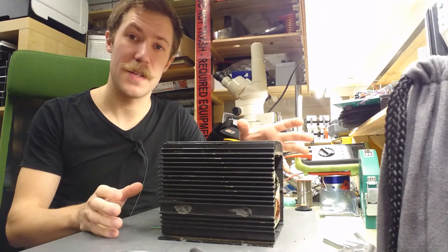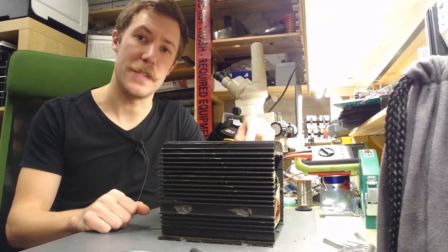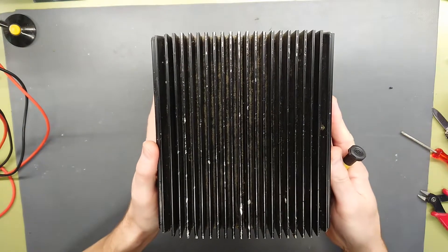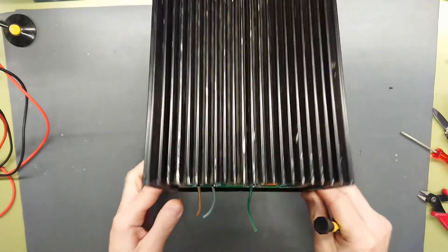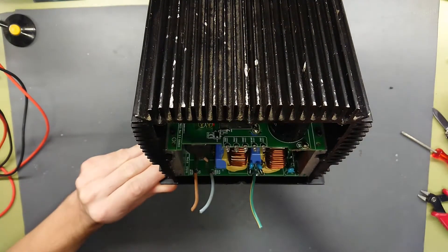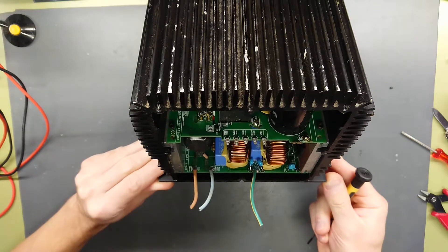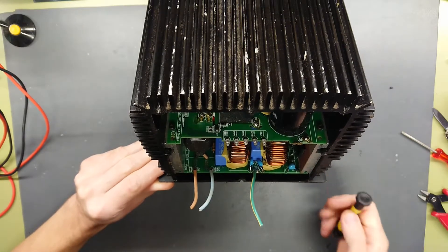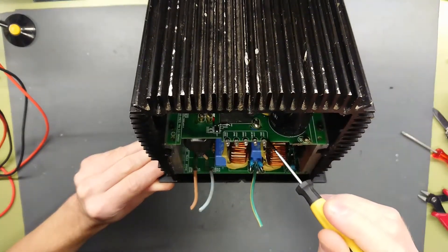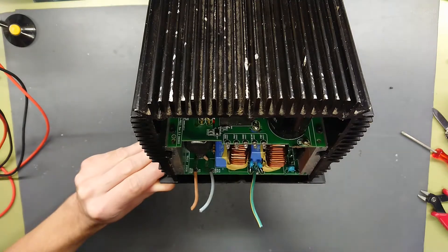It does have a few markings on the PCB that suggest this is probably a battery charger for 12V or 24V DC. Looking on the inside, it says SMF 2420, which turns out to be a Signet system manufactured 24V DC 19A battery charger for lifts and trucks. It's also a pretty much a giveaway that on the PCB we have LEDs labeled 'gel' and charge status indicators for 100%, 75%, and 50%.